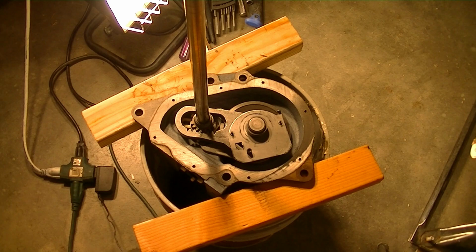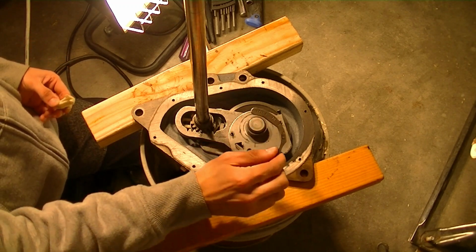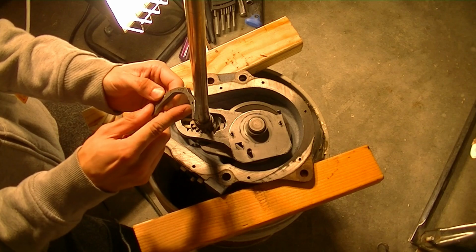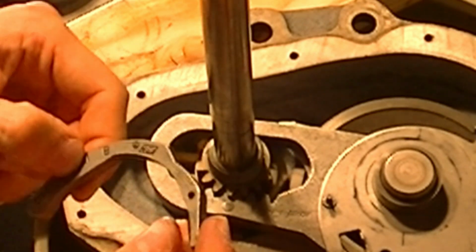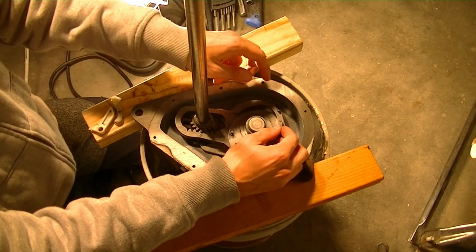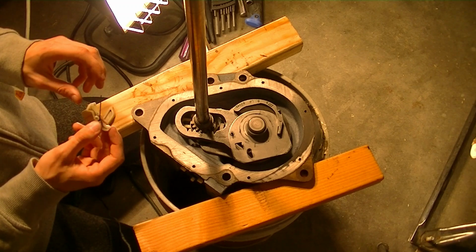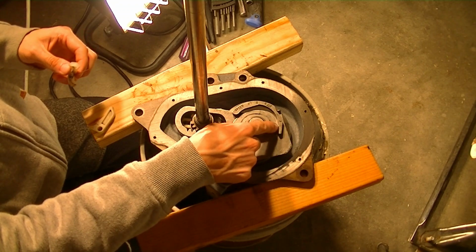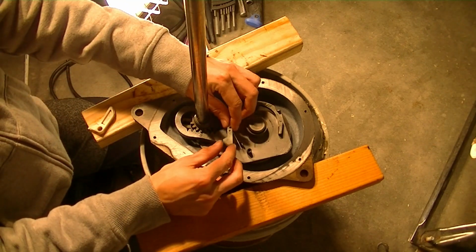So pieces like the latch and the spin pawl and the trip lever go in next. So this piece is called the latch. It's weighted on this end, and one of the key things to note about this piece in particular is it has a little hook right here that would grab onto what could be referred to as a cam, or in some cases I've seen it referred to as a tang, because it's like a catch that rides on the under hub of the spin gear, which I'll show you in a moment once I get all these pieces in.